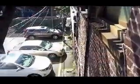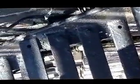There's two brackets here. Again, you can see there's almost a dimple in this. There's so much stress from rust and loading. Okay, we're going to start the last part down. All the stairs are in the same configuration, but there are some problems. Some of it feels a little spongy, and you can see, like here, for instance, that the bolts or rivets that were there are completely gone. So that's all suspect. And we're going to continue down.